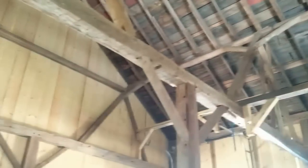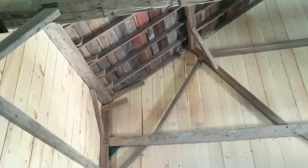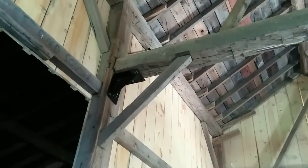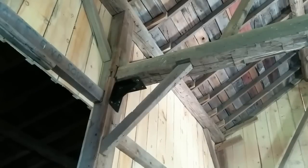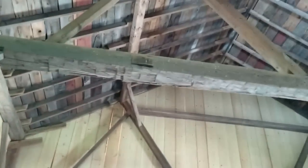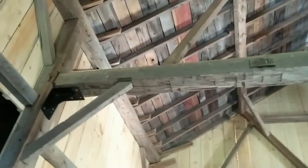This is one very good way to restore an old barn. They've got hardware in it, but it's better than — it's not a 100% authentic restoration. But just think of what you would have to do to restore this authentically. If that tenon is broken off the end of that beam, then you've got to replace the entire beam. Then you have a fresh looking beam strung across here that you have to somehow match to the color of the rest of the beams.